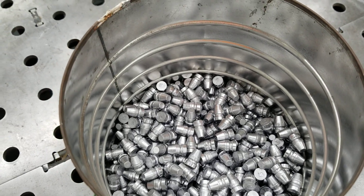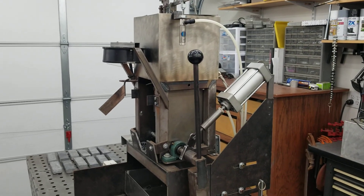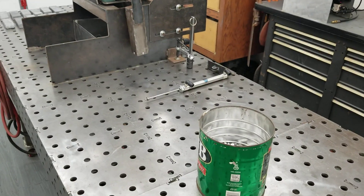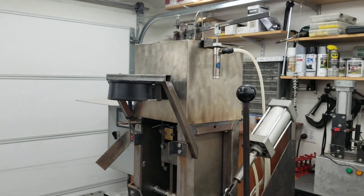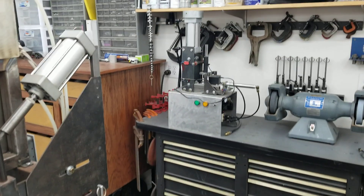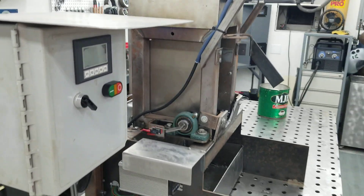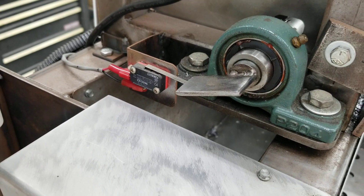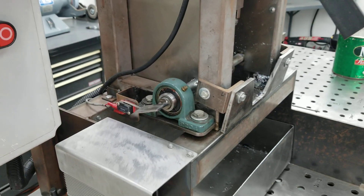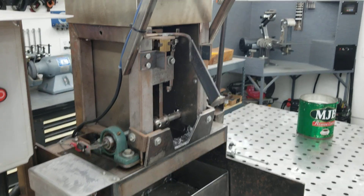Here's what I cast last night. The machine isn't as fast as some, but the whole point was to let the machine do the work instead of putting wear and tear on my hands and wrists, so I can sit here and sort through bullets and feed the machine. My pistol bullets get powder coated and then run through the automated sizing machine; the rifle bullets get aluminum gas checks and traditional wax lube. Here's the switch for home position — this triggers it to start the cycle over and pour the lead. On the PLC I can adjust timing on almost every aspect of the machine, so it's pretty easy to dial in.